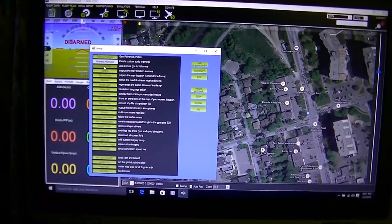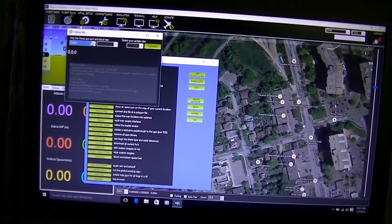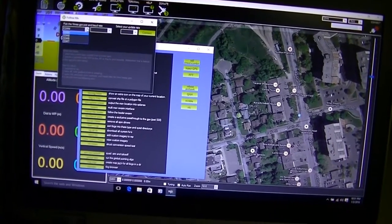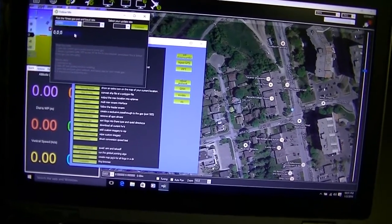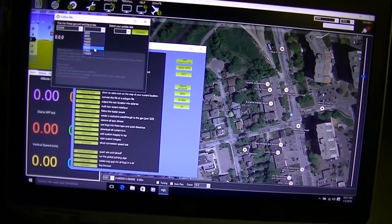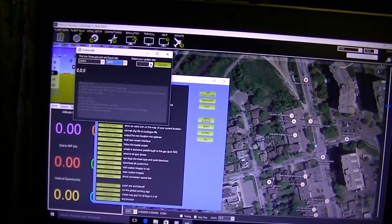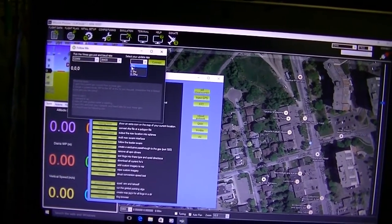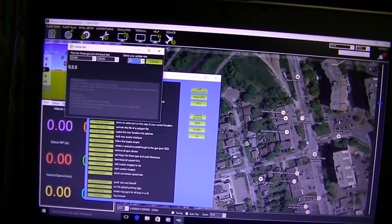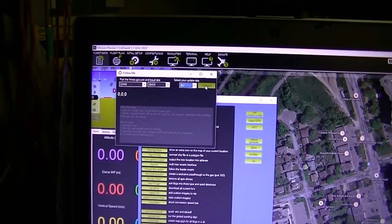So here we are back in Mission Planner. I use the Follow Me. It brings up the GPS communication. And in this case, I use COM9, and I just happen to know, you can go by trial and error, but I happen to know that this Bluetooth display uses 38400, and it does at least 5 Hz update. So I'm using a 2 Hz update, which is the highest one that Mission Planner seems to support.